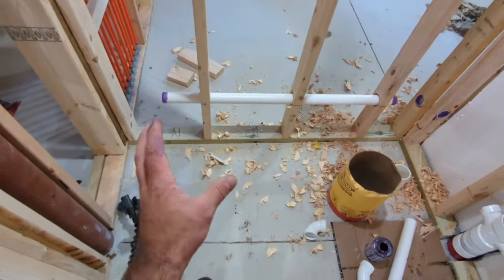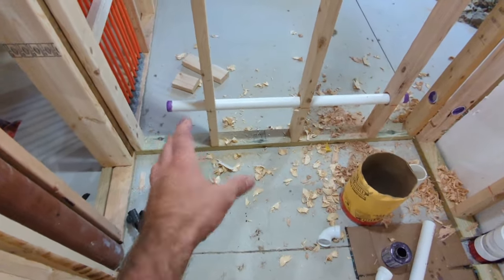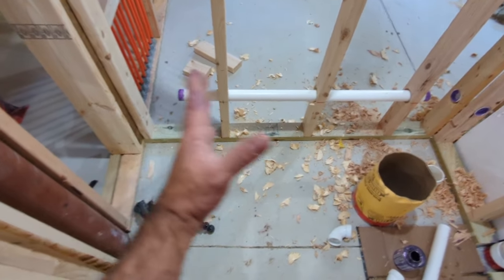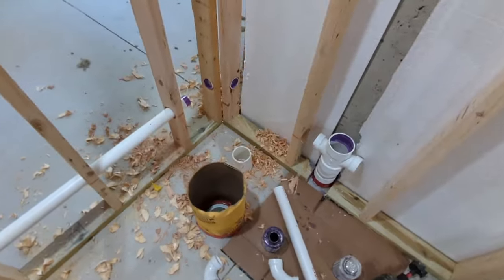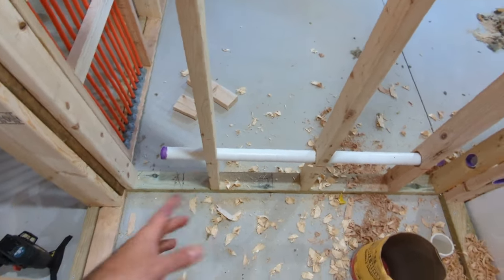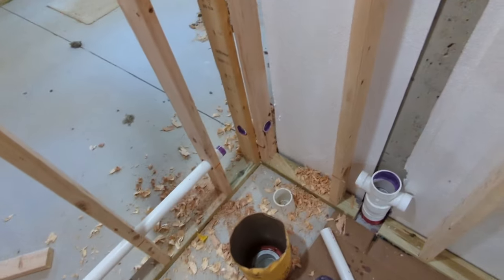You have the ability with finished plumbing. So this is your rough-in to your adapter nut, and your finished plumbing is your P-trap in that. You have the ability to find that anywhere you are in the cabinet. You can really go to one side or the other if you really wanted to, but I'm going to avoid it. We're going to shoot for close to center.